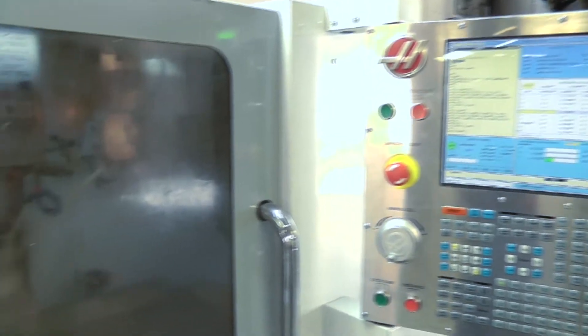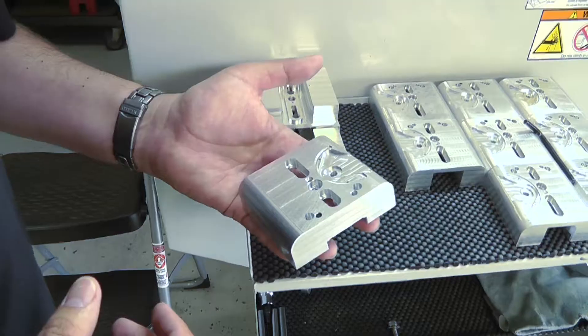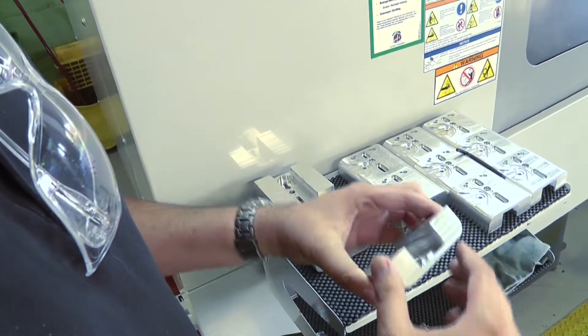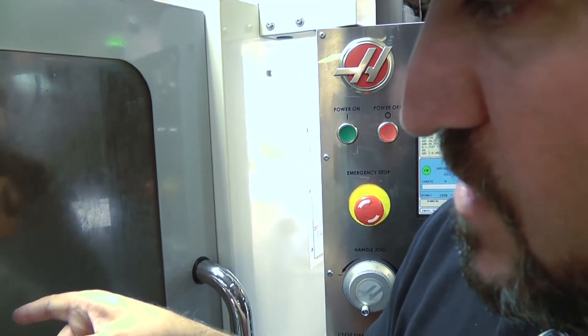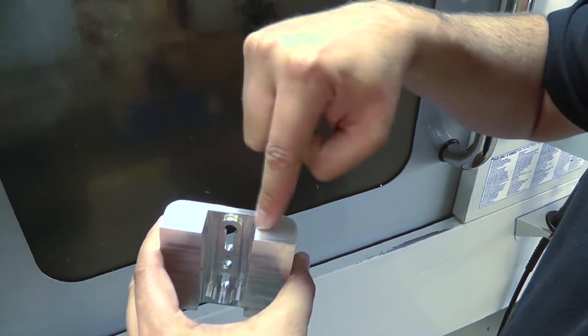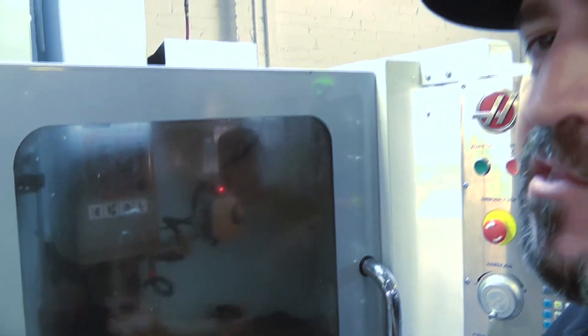Here you can see all the different steps we have to go through for the production of just a single bridge plate. Each one of these machines is set up for a particular pass on the bridge plate. Right now we can see a Micron bridge plate that has gone through two of those steps already. This is a stage before the lightweight holes have been drilled out and before some of the other passes underneath. This is the machine that does the 15mm bores on both sides. Right now it's doing the chamfering stage — taking the hard edge and cutting it to a 45-degree chamfer so it's a little softer on the hands.